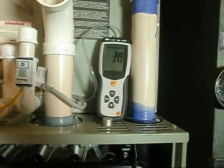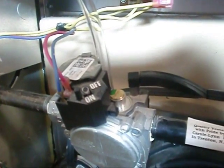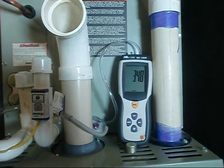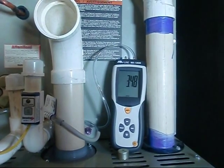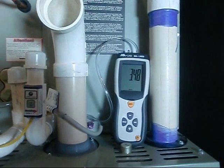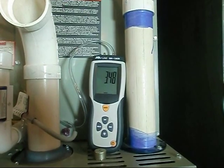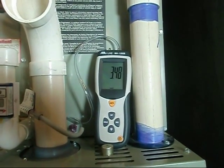That's a wrap on that. I've got the set screw back in there covering the adjustment screw. Furnace is fired up, blower motor's kicking — we are in the heating mode. Just wanted to check her again. We were looking for 3.5 — we're at 3.47, 3.48. I just didn't want to go over. Man, I can't help it, I just get so excited doing this. I think we're good. Hey Jason, thanks for turning me on to this, brother — I love this manometer.